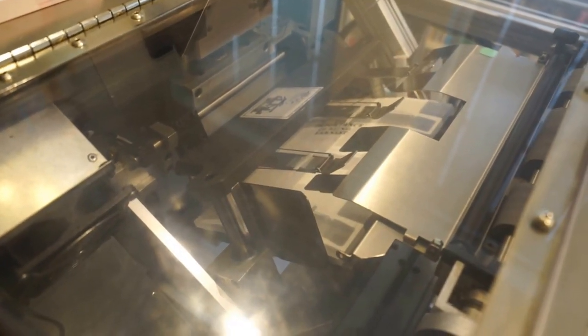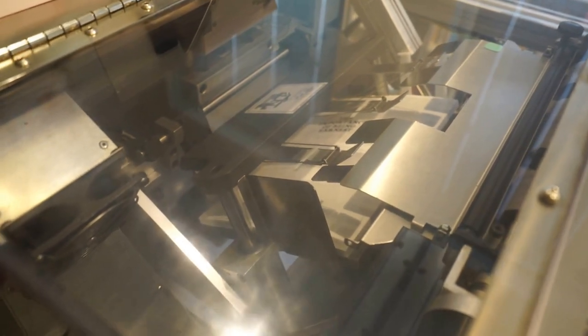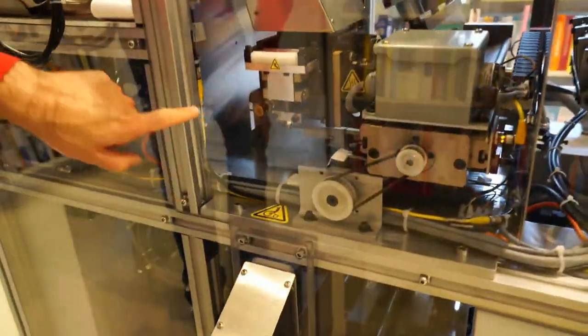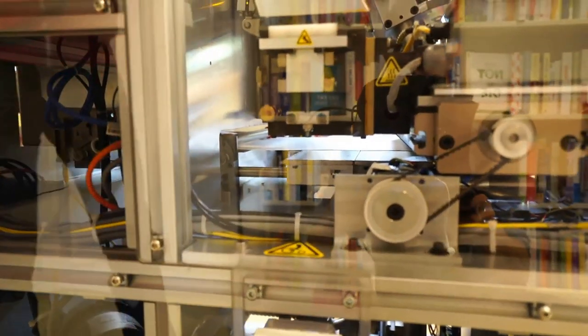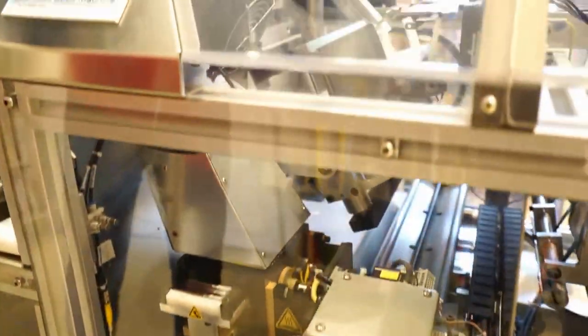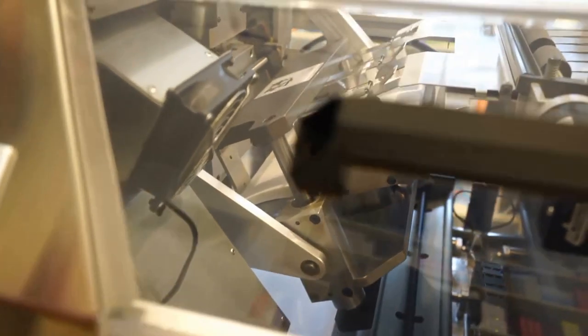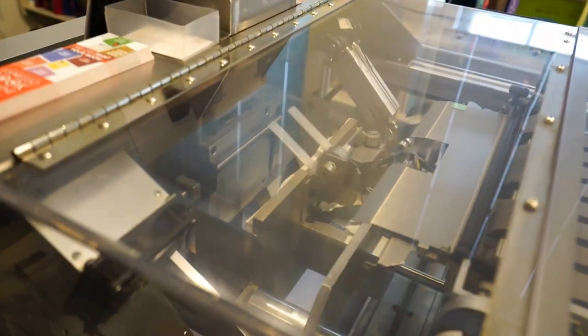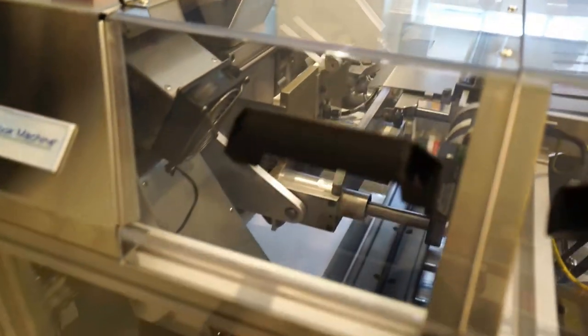Well, that was the last sheet. So now the book block is ready. The cover is also already in the machine — it has run through the outside and is now lying flat on what we call the binding table. What I'm going to do now is start the second phase. It will squish the book block together to hold it nice and tight, flip it around, move it up so the glue pot can go under it, bind it with glue, and then press it into the cover to make sure that it's nicely bound.